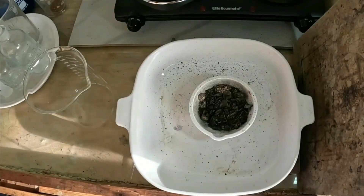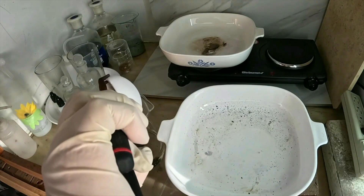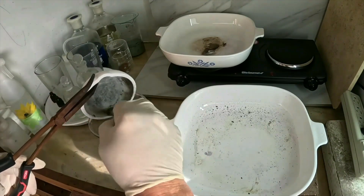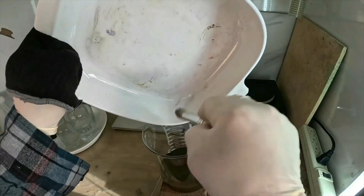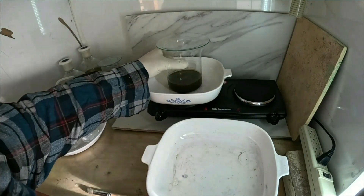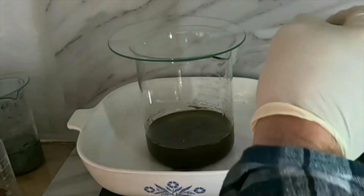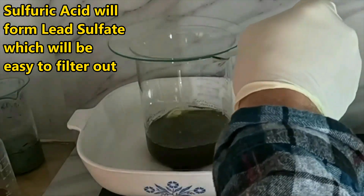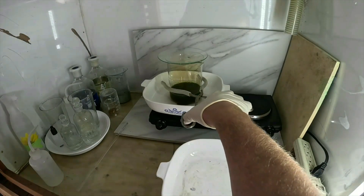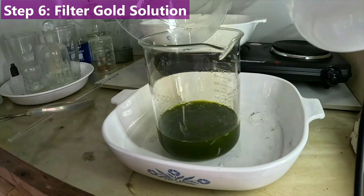After incineration, we're going to put some hydrochloric acid into a beaker and then transfer the material into that same beaker in preparation for the aqua regia process. Aqua regia is a combination of hydrochloric and nitric acids that will put gold into solution, forming chloroauric acid. For this batch I'm going to add about 10 milliliters of nitric acid and approximately 2 milliliters of sulfuric acid. The reaction is done — in total I added six more milliliters of nitric — and now I have all the metal that will go into solution. The color of our gold solution tells us there's a lot of other stuff in there.